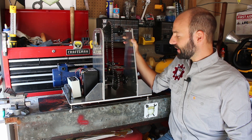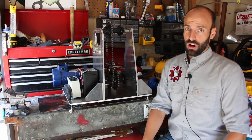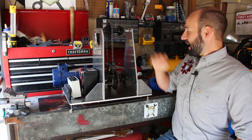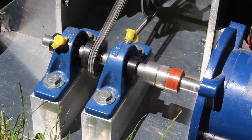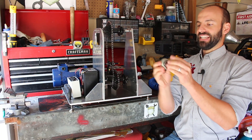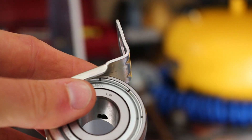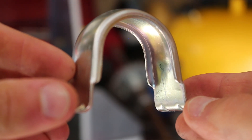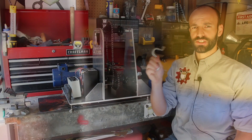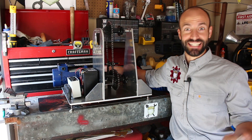I like the aluminum frame. It's light enough to be portable and it's strong and quite solid. I like the cast bearings. We started out using cheap stamped bearings — they're rated for real high radial loads, but if you have any kind of bending moment on the shaft or axial load, they don't do so well. Those little stamped housings deform so easily, and that's why you can get these for six bucks while the cast ones cost sixty.